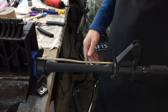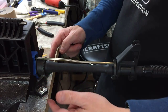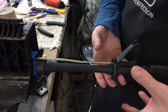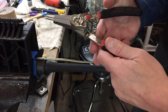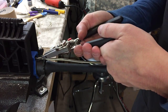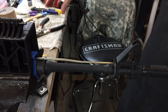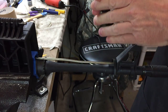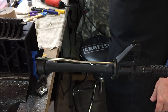Now that I've got that touched up, the last thing I need to do is remove this split ring right here. This split ring actually holds on the delta spring and the delta ring. This is what you would remove if you took the whole barrel assembly off — you'd remove this and then remove everything from the rear. Normally you need a tool such as this, which is a split ring pin removal tool. You may not have one of these. This particular tool is not designed for working with these rings — normally I cut these off. This is kind of what the tool looks like, or at least what a tool for doing split rings looks like. You can also pry this apart with a small flat blade screwdriver.